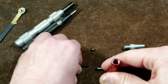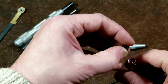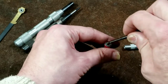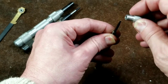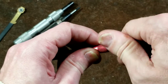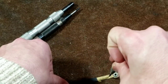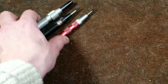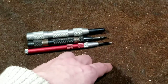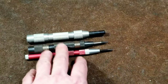Because we just put that in there, drop the spring in, ball bearing, the hammer, the little concave piece facing the hammer, the tip, its spring — we put all that into here, and then get the front piece on here. That little clip also prevents the tip from falling out of the front of it. And voila, we put it back together — easy. It works absolutely perfectly. So that is one nice thing about these — they can be fully rebuilt, and the mechanism will essentially easily outlast the tip. And that's really the big issue when you get one of these: trying to find replacement tips, because they all seem to use their own special tip and there is no real standardization.